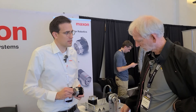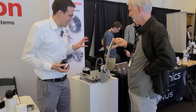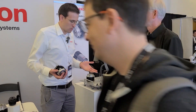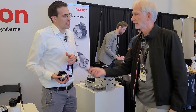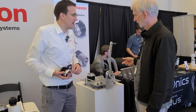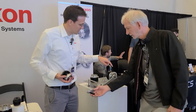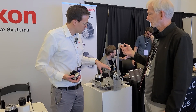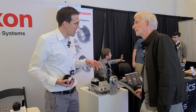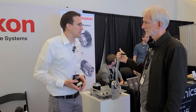You've got some little apparatus here — can you explain what this is and why I should be impressed with it? When people touch it, we get two reactions. Reaction one: what's it doing? It's absolutely not doing anything. Reaction two — when a person from the industry comes — they're like, oh my God, how can this be? It's controlling for zero newton meters at the output port. The whole torque controller is running, controlling for zero newton meters, and all the compensations — friction and cogging — are running. What you feel is nothing, which is amazing, because that's how it should be for a very well-linearized drive.